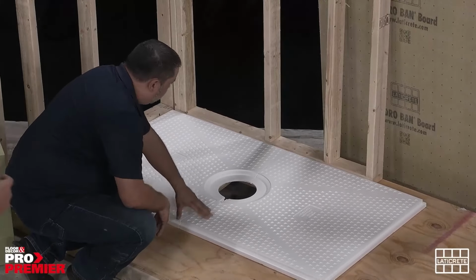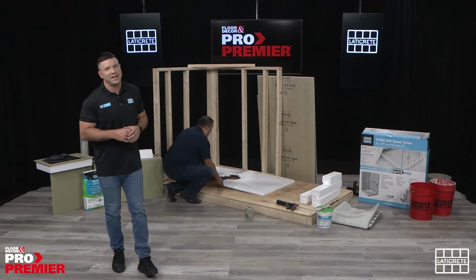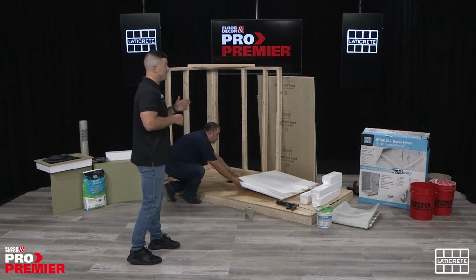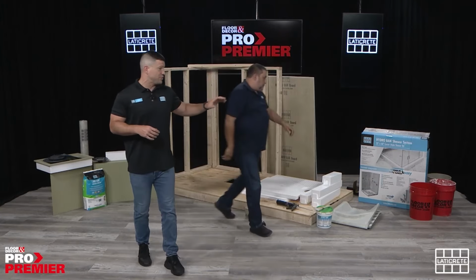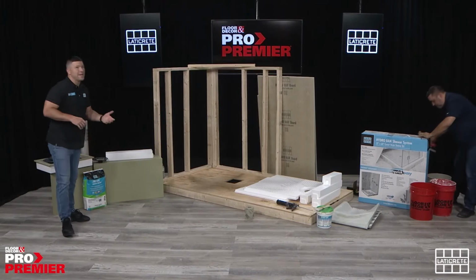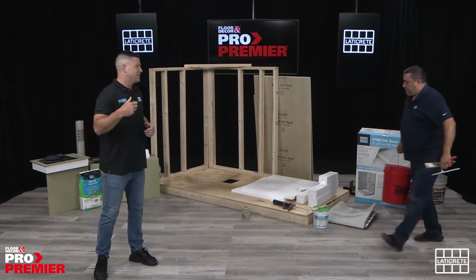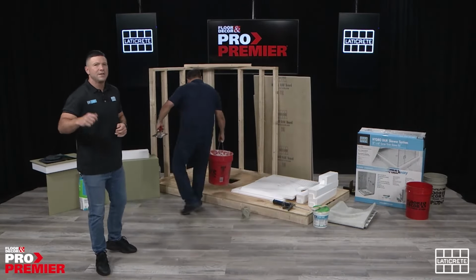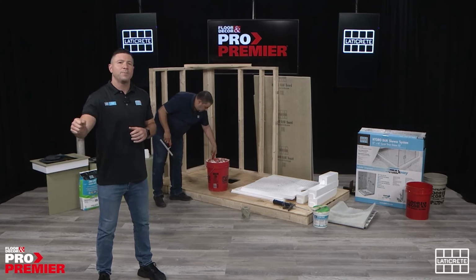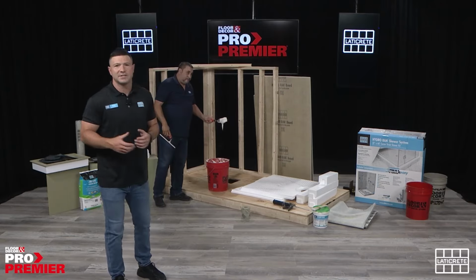So now that we've established that the pan does in fact fit the way we want, we're gonna go ahead and get started with thin setting the pan down to the substrate. Now for liberty and timing purposes, we've already mixed up a batch of thinset. We have our Tri-Lite, which is a very versatile, lightweight mortar that works with a number of different substrates. It's easy to use, very versatile in nature, easy to spread, and very lightweight. So again, eye on the contractor, eye on longevity. We wanna put less strain on those muscles, both through transportation to the installation and during the installation itself.